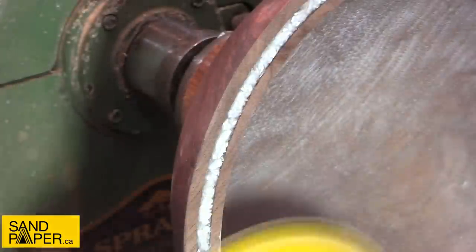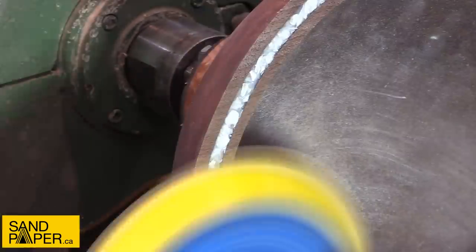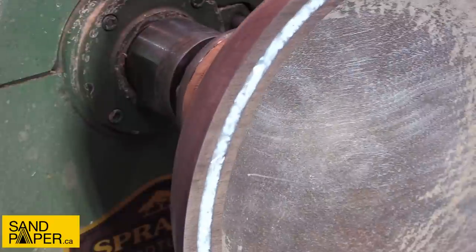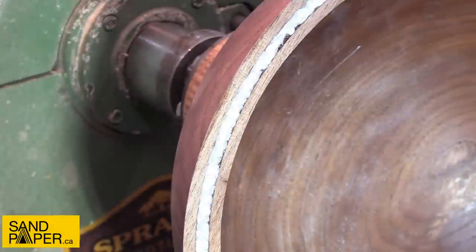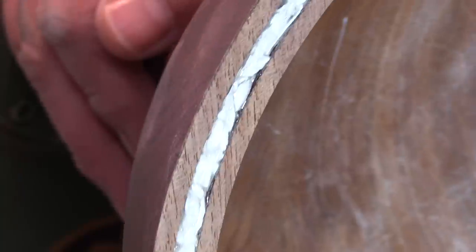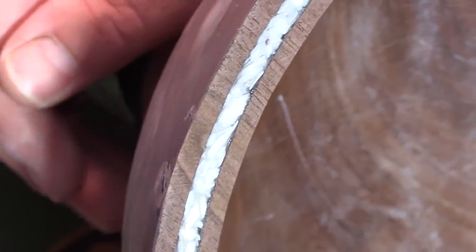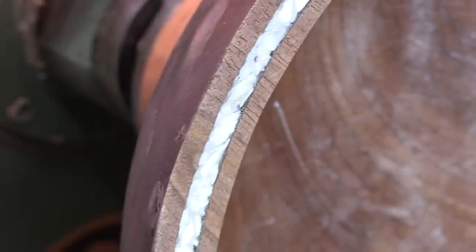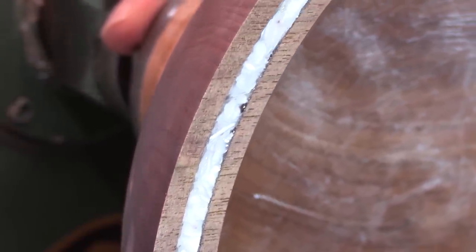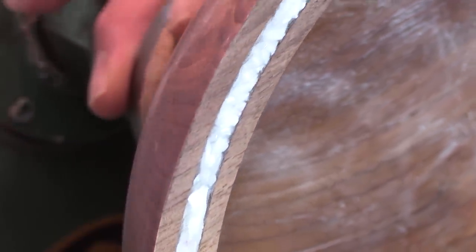Now, of all the shells that I work with, I do find that oyster is probably the easiest to sand. So you could probably bring that glue right up to the very top surface of the wood, and it's usually not too bad to cut it back. And there you go, there's an extreme close-up. Still got some of those little areas on the side that are going to need the fine filling, but other than that, this one actually filled in a lot better than the mussel shell and the abalone.